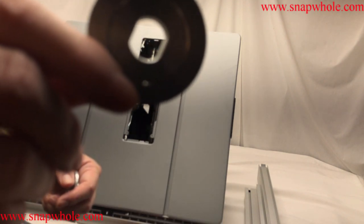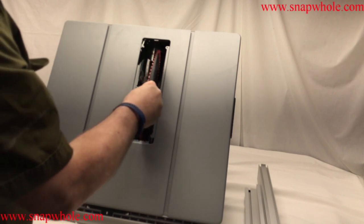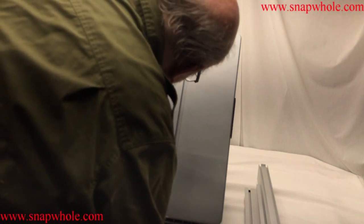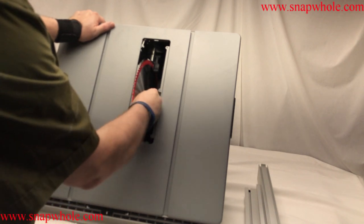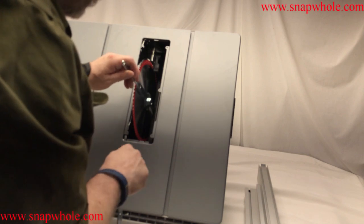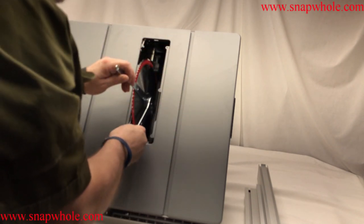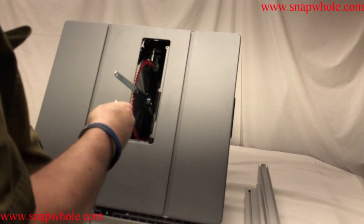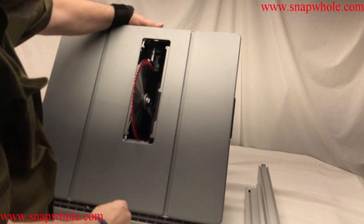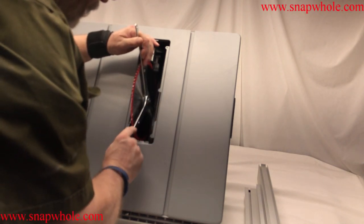Here's the two flanges. They're set together with the blade in the middle, and that's what holds the blade from spinning. The outside one has an oblong instead of a circle hole in it. So you take the one that's got a circle hole, put it on, put your saw blade on, just slip it down in there. When I went to put that blade on, it only goes a little bit on. If I can just get this nut on, I can torque the nut down and hopefully force that on, but it's not the way you're supposed to do things. Two wrenches, turn this wrench toward the back of the saw. I'm actually press-fitting the blade into that. Once I got past the lip, that went further on. It's just the lip had like a little ridge on it that kept the blade from going on. I will say the first one of these I had had no problems mounting these blades. You don't want to over-tighten this because you've got to get it off.